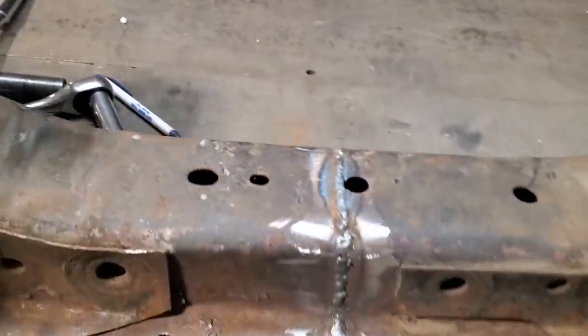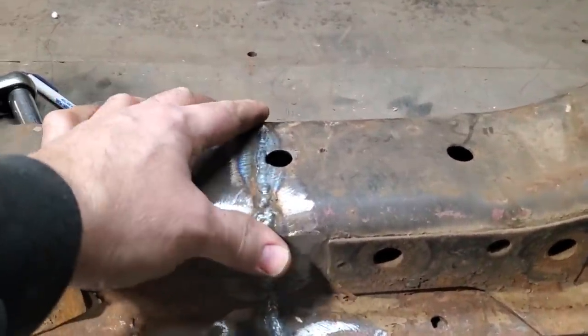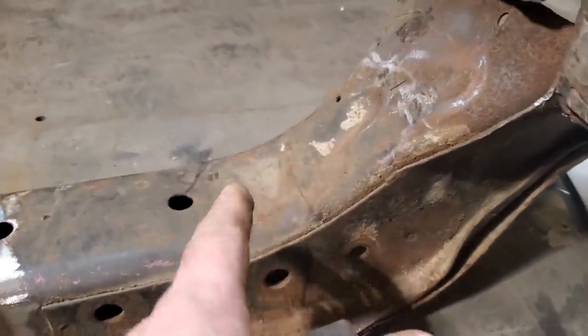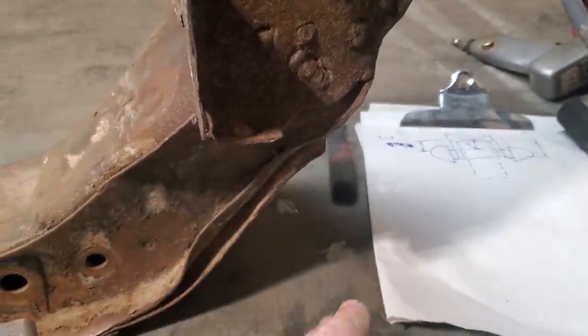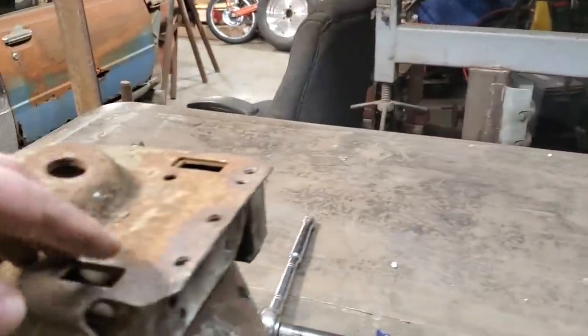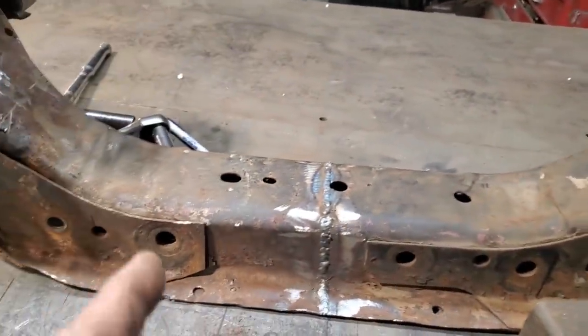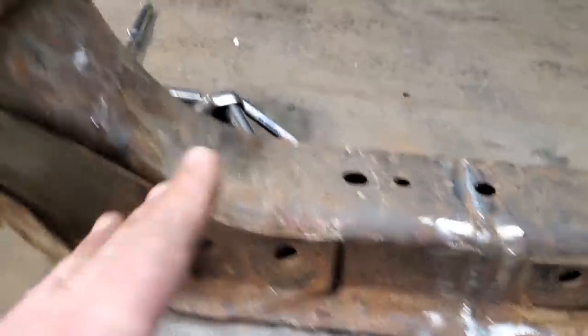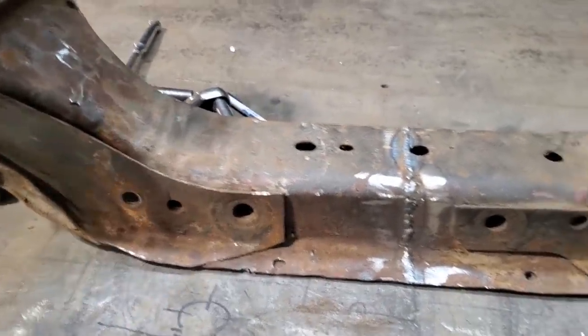That's one of the reasons why I did it this way, to cut this here. So now I've got everything figured out where everything has to go. And what I'm going to do is brace this section over here to the bench. I'll just take random scraps of steel and weld them to the top of the bench so I can cut this clean right off. I'll take my measurements once again from these points, the X measurements, one from there up to this one here and straight across, and whatnot. And then I'll have all the measurements to go by before I do this. And I'll make the entire frame to weld to the bench and then fit this into it. So I'm going to go ahead now and clean all this up and get this all dressed up and ready to go so we can start cutting it up.